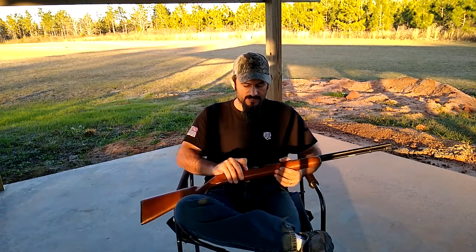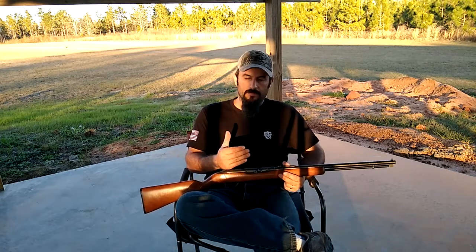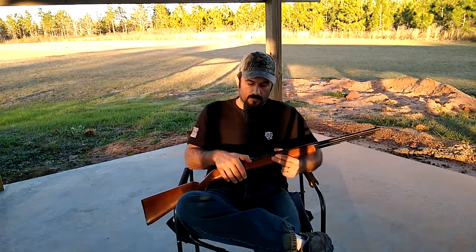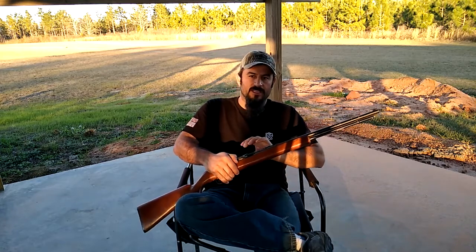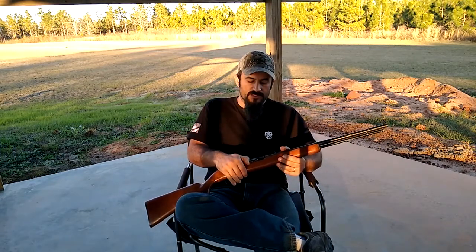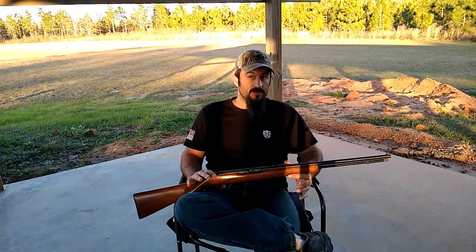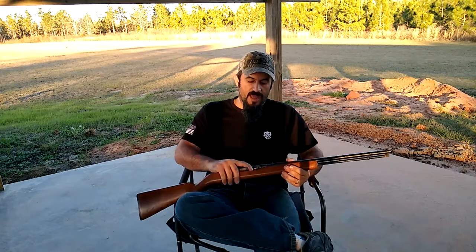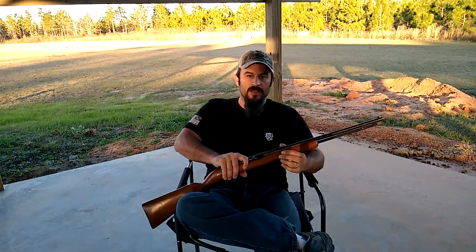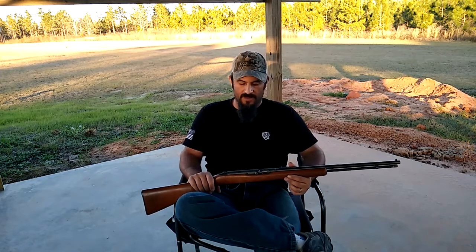In this specific gun, down at the bottom of the magazine tube there's something called a cartridge stop. The cartridge stop applies pressure to the round and prevents it from being ejected from the magazine tube upon the bolt coming back. That cartridge stop spring is actuated and pushed out of the way, allowing a cartridge to be thrown into the magazine well. Upon the bolt starting to move forward, a lifter lifts the round up and allows the bolt to chamber it. When the hammer falls, the round fires, gases blow the bolt back resetting the hammer, ejects the cartridge, and a new one comes out simultaneously. The bolt goes forward, the lifter chambers a new round, and the process repeats until you run out of ammunition.